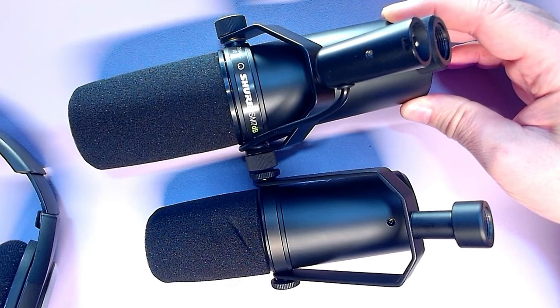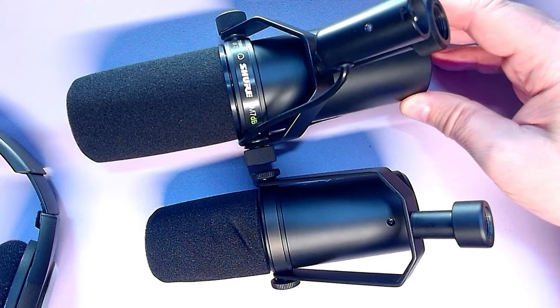It really is like a mini SM7B, which is pretty cool. But that is kind of where it ends. This microphone has major issues — and I have two of them. I found one for next to nothing, tested both, and both are almost impossible to drive. The preamps on my Yamaha AG06 are basically maxed out and I'm still only hitting negative 18 dB, maybe negative 15 dB if I get a little loud. There is an issue in XLR mode and it's on both mics.